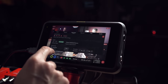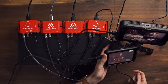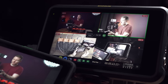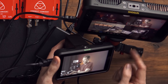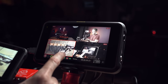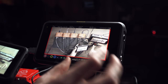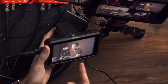What I was saying is that the transitions don't actually show up on your preview. I have the program preview showing here on the Shinobi, and as you can see, if I go to transition and press go, the transition takes place on the Shogun but on the Shinobi you can see it's not doing anything — it just cuts. When you switch on the Shogun, you'll see a flash of black before it goes to the other one, but that flash will not show up on the preview; that's just this screen loading the full feed. The transitions aren't displayed on the external monitor.